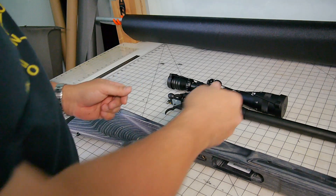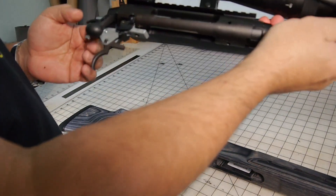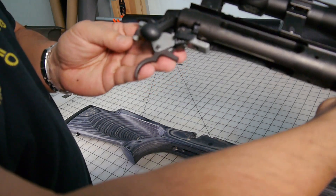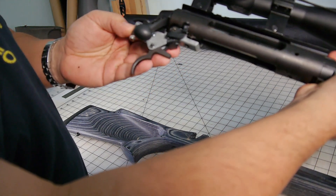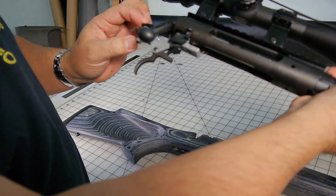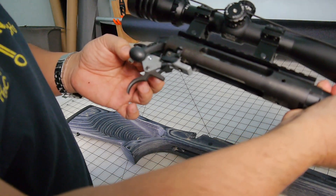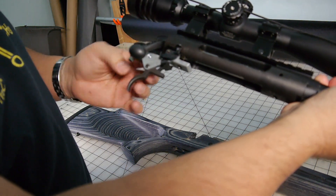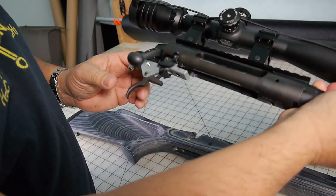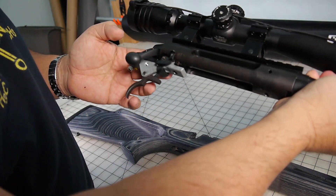The next round, I did a trigger job, as you can see here. I put a cap screw on it. The trigger itself is the same — I just replaced the cap screw and the spring. I spec'd out the spring; I wanted something measurable, not just pulled off a ballpoint pen or something. I can get into more detail if you want — just send me a note.